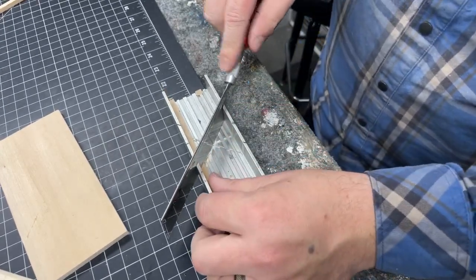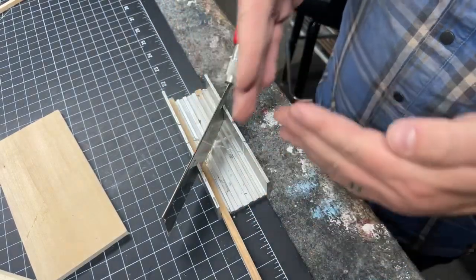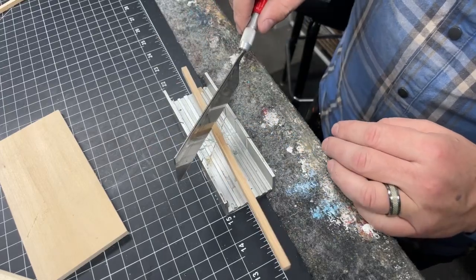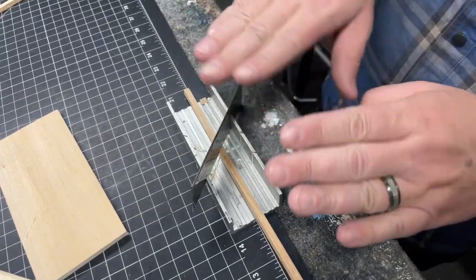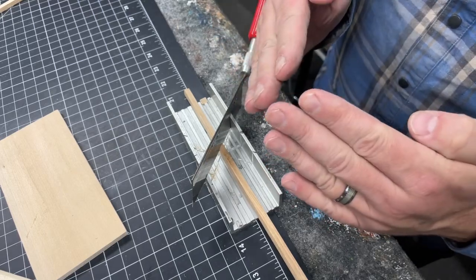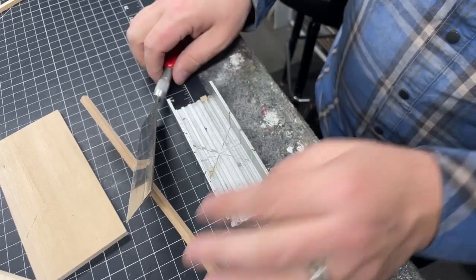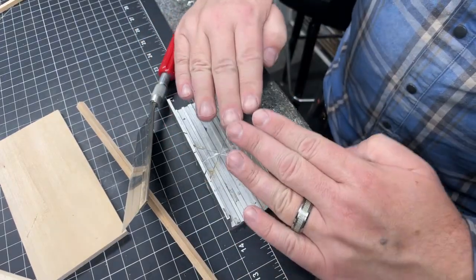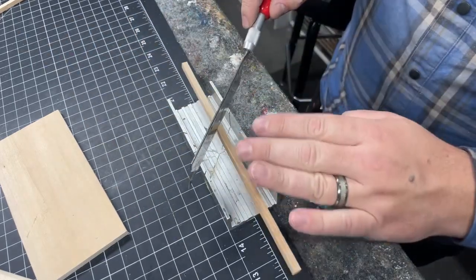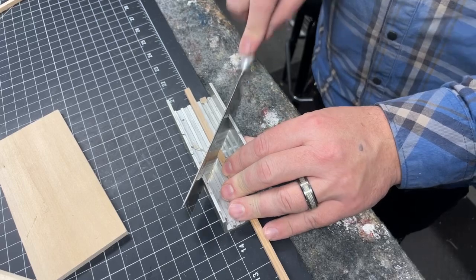Sometimes you get a piece of wood that's bowed, and it's bowed up or down or back, and what you're doing is you're fighting the push of that bow. So this one I can tell is actually bowing upward. It's bowing up like this. So as I push down on the wood and move my saw, the cut opening is wanting to clamp down on the saw. So as it's bowing up and cutting and I push down, it's going grip, grip, grip, re-gripping onto the saw. So sometimes you have to figure that out and let your finger off of the wood a little bit so it will cut.